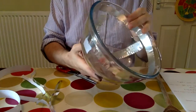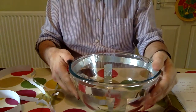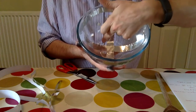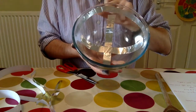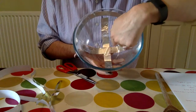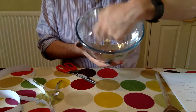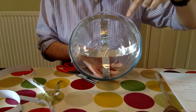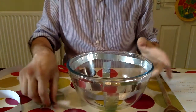The last thing I'm going to do is put four thinner strips on the inside. These start from the edge and go up over the edge, touching the aluminium foil around the edge. Essentially, the cross in the middle is going to get one charge — let's say positive — and the ones going out the diagonals are going to be a negative charge, connected to the ring around the edge that we're going to make negative.